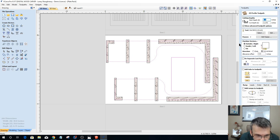Now, at this point, when you're doing your profile cut, you decide: if it is going to be a two-sided project where you can do your decorative carvings and all that, then you're only cutting halfway through. If it's just going to be a nice, plain, clean piece, then cut all the way through. You're not flipping anything, so cut it all the way through. I'll set it up as a two-sided part, and I'll come back and see if I would do any decorating. We're not going to do any V-carve decorating on the other side today. It's already 10 o'clock, but I'll still set it up as a two-sided thing. So this is sheet three, side one, profile, 0.25 end mill. We'll calculate that.